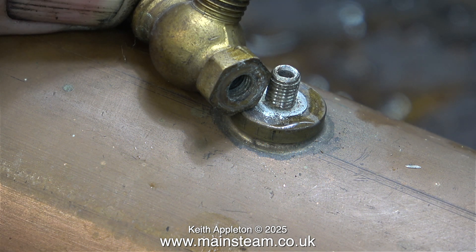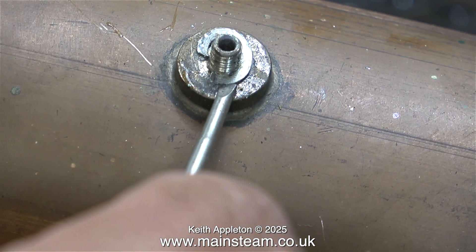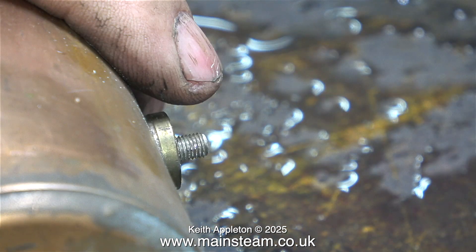The Stuart steam taps on these boilers were not corroded at all because they use a stainless steel insert, which doesn't react. Cathodic corrosion still takes place on stainless steel, but at a much slower rate. Once again though, the aluminium washer is almost corroded to nothing.